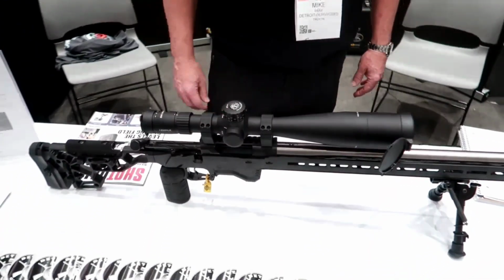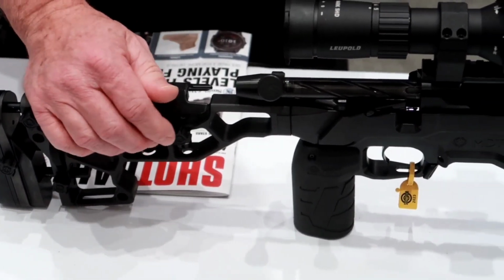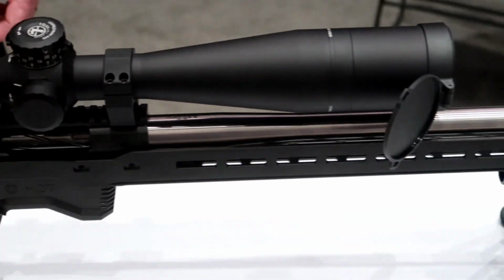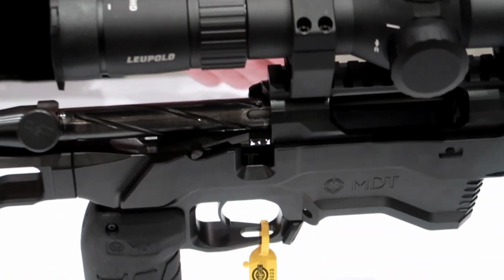Gunworks, and we were based in Troy, Michigan. Originally, we were the only FFL in the city of Detroit. And what we've created is a three-lug bolt-action rifle. We're focusing on high-precision actions for the PRS crowd. We have a 60-degree throw, three-lug, all EDM raceways and bolt faces.